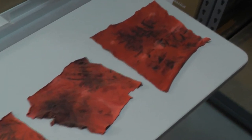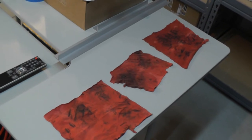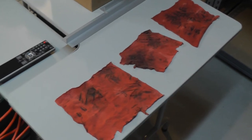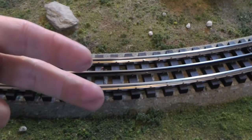This is what I picked up on these cloths — there's 90% alcohol on them and I wipe the tracks down with them. This was after I had already gone across all of the tracks with one of those scotch-brite pads with alcohol on it, so this was residual. Before, when I did this, a whole bunch came off on my fingers, but now you can see there's a little — but not very much.